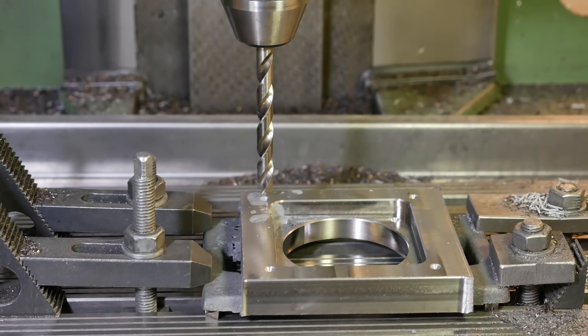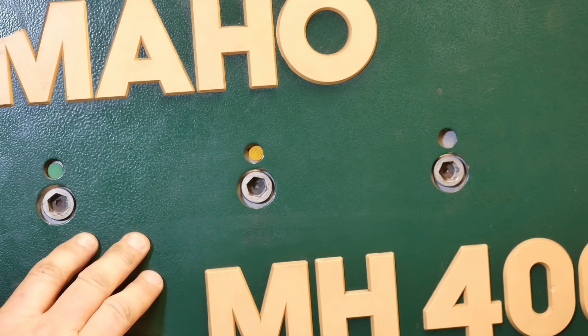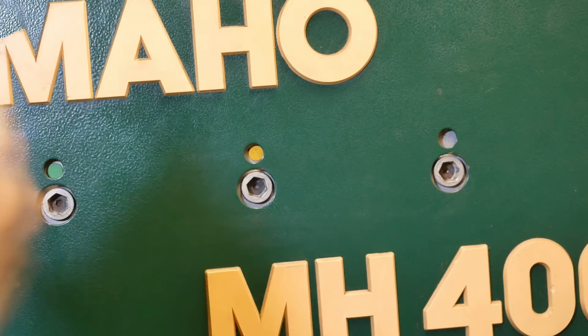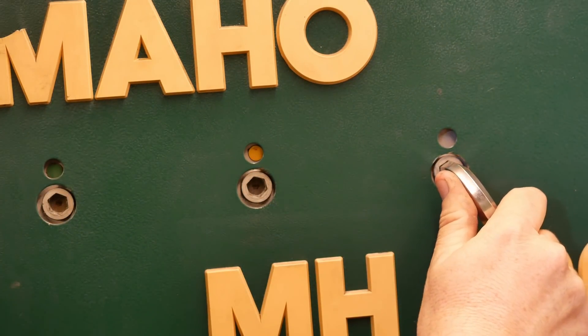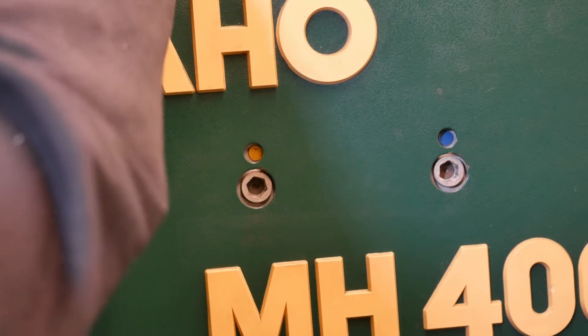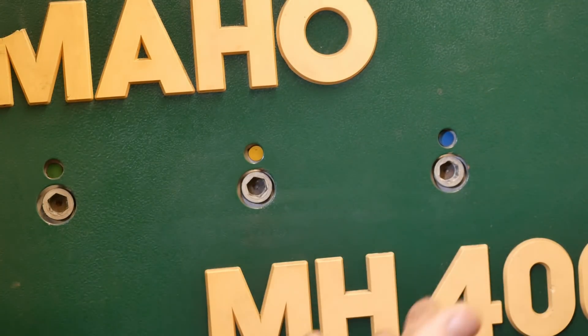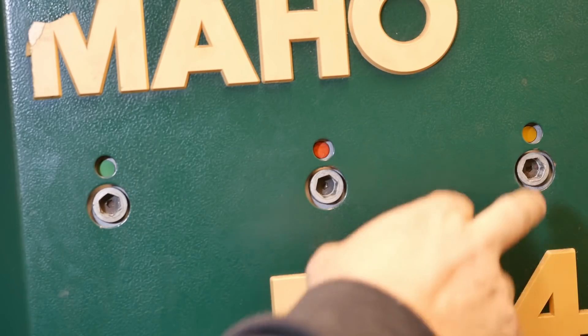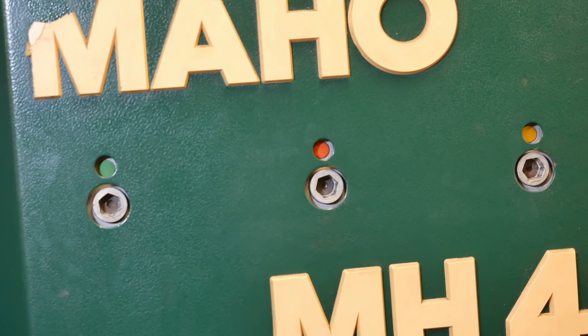Okay, I had to e-stop that. Can you hear the clicking? Those are the gearbox relays — the gearbox isn't changing. I haven't had that before. The three shifters on the Maho gearbox are color-coded when they're in gear. This one's not showing a color, so what I'm guessing is it was between gears, and therefore the twitching, which uses the main motor, stopped here, and one of the others was jammed maybe. So let's give it a speed command at 2000. It looks like that was the problem — for whatever reason it got stuck between gears and then couldn't move on to the other ones. I'll keep an eye on it.